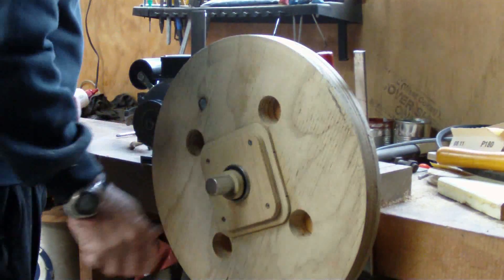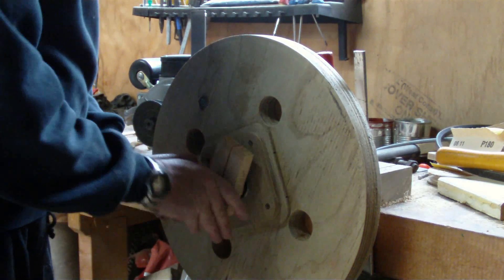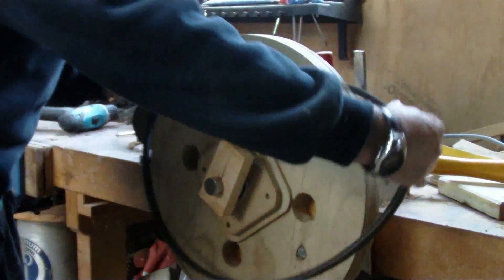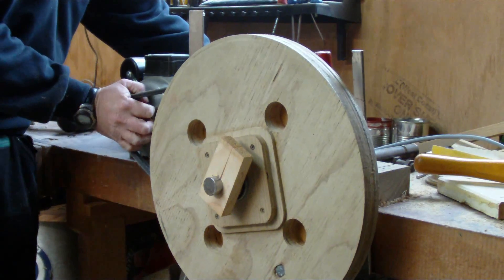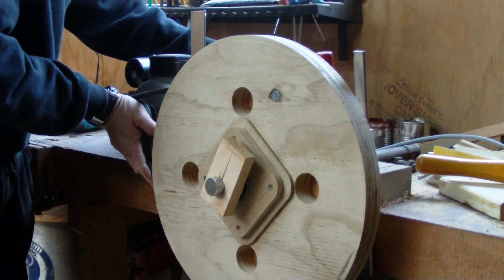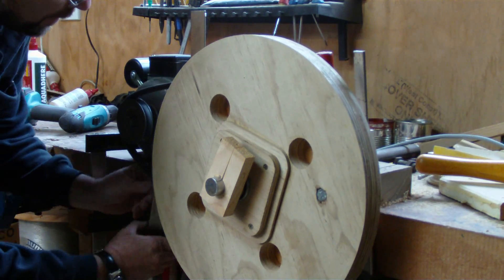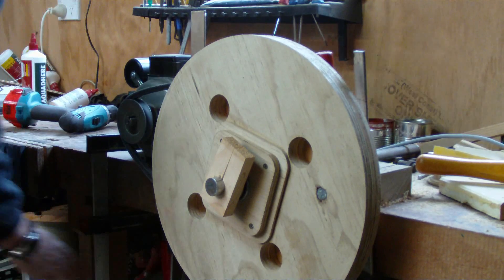I've also got a small wooden ring here and this piece which is basically just a clamp — it just goes on top there. I'll just close up the gap like that and now that won't come off. Next I need to put on the belt onto my temporary pulley and just tension my motor back. I'll position the motor so the belt is kept clear of the wheel and just clamp the motor down to the bench. That shouldn't be going anywhere in a hurry.